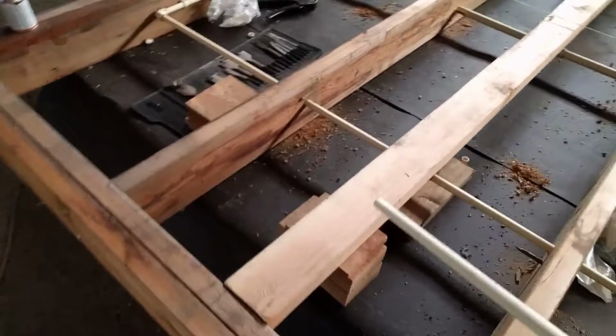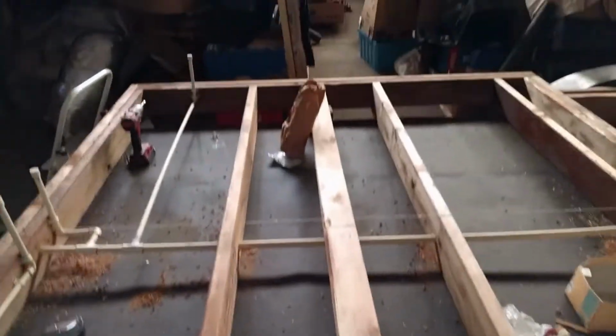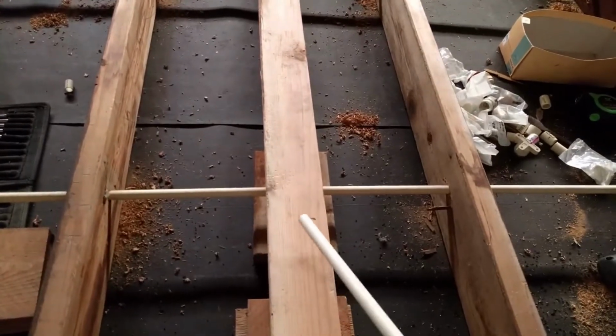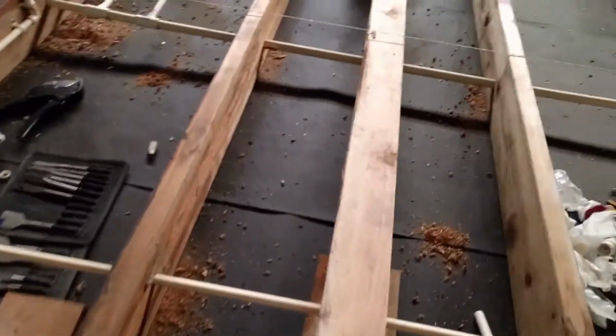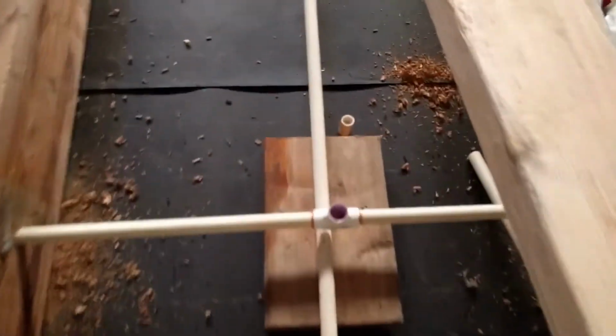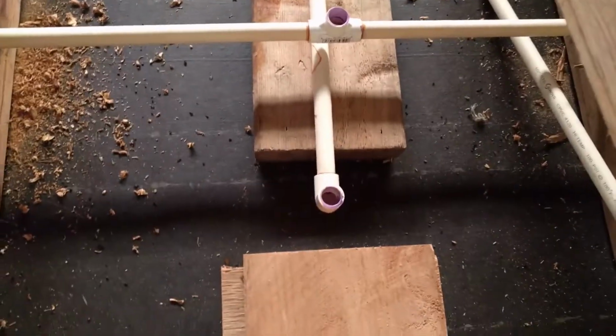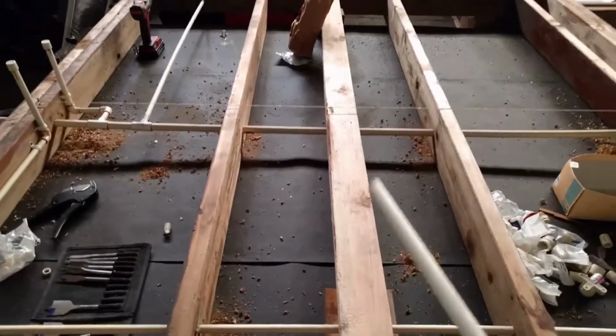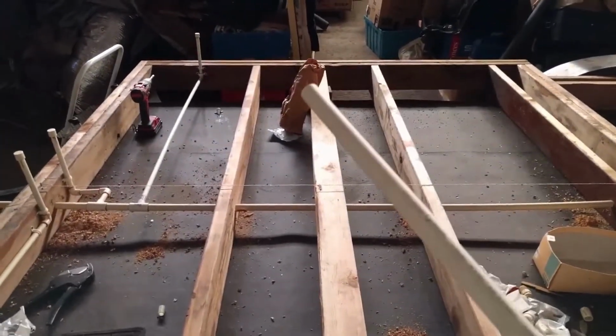And right here is the bathroom wall. I'm going to build this wall out of 2x4 because it's going to be holding the valving for the shower. And if I lift this 2x4 up, I don't have it hooked in yet, you can see the 2 stubs: that's the cold water and that's the hot water. And that's for the shower. But the shower valve will be up inside this wall here.